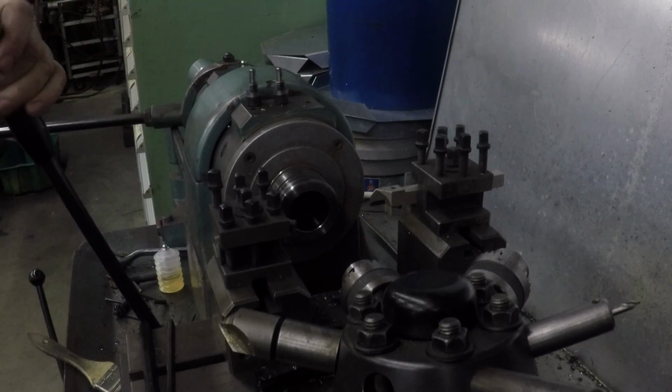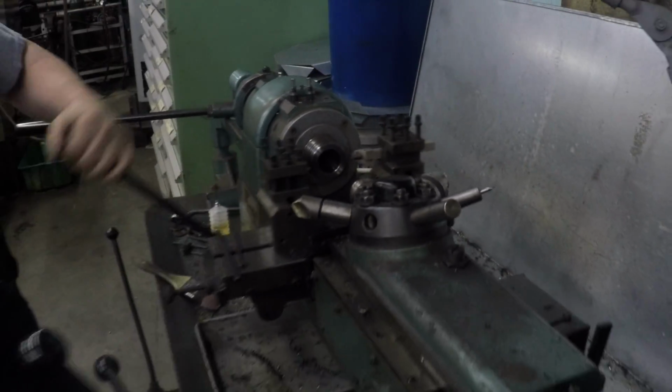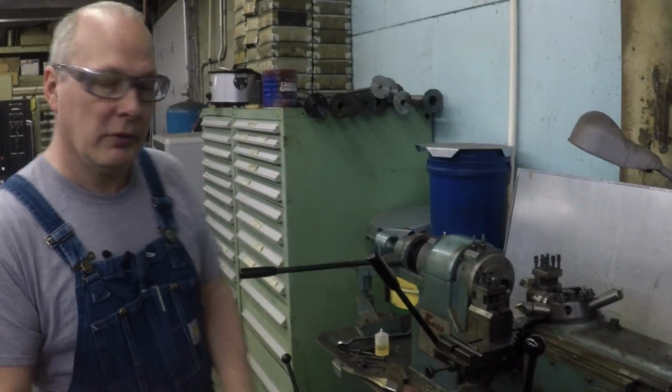One way and chamfer the other way, just like that. Part and chamfer. That's awesome. And you've got stops on here. You can set the stops on how deep you're going. So some setup time, but man, then you can cook. That's right. And generally, what we do is we'll have something on bar feed over there on the Seiki.